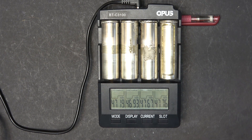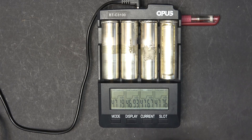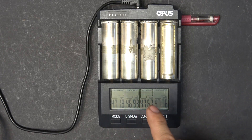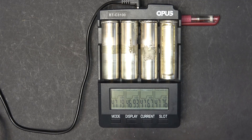It's been several hours and the discharge test is done. These two are close to 4.7 amp-hours and these two are close to 4.8 amp-hours — very close to the original manufacturer specs of about 4.8 amp-hours. So even though they were completely dead and discharged, they are still revivable and the capacity is still very close to the manufacturer's specs.